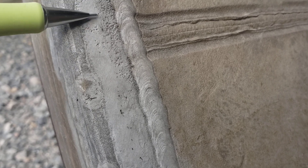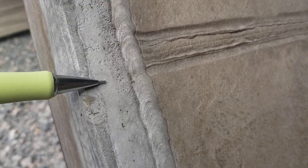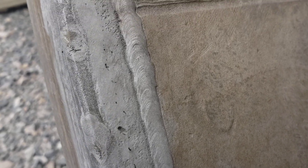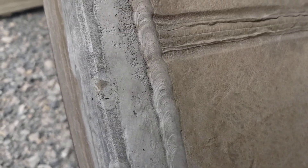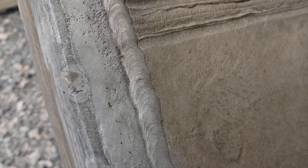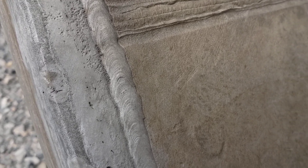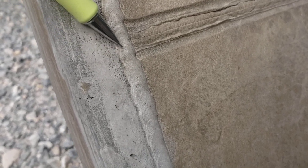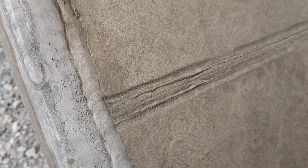Here on the edge where there was some weld metal repair, right at the gasket sealing surface and the adjacent area, the weld has got these really tight pinhole-style pock marks — where the corrosion is attacking the actual base metal itself in very small, tight spots.